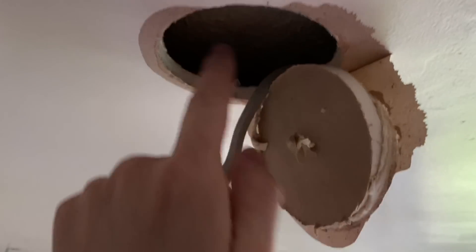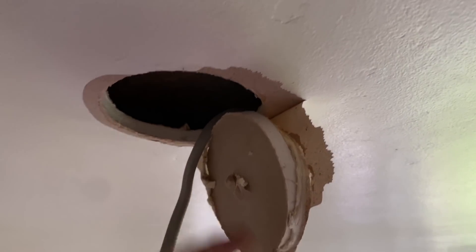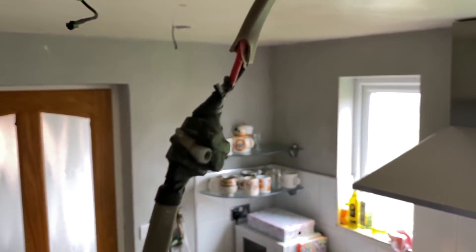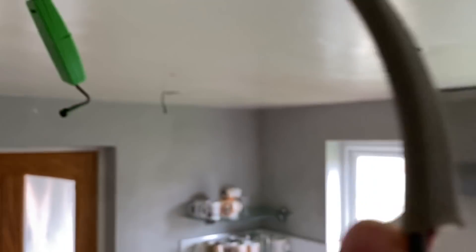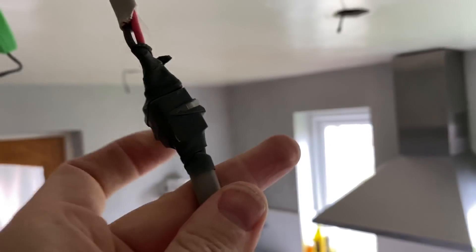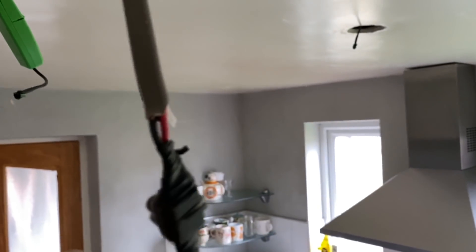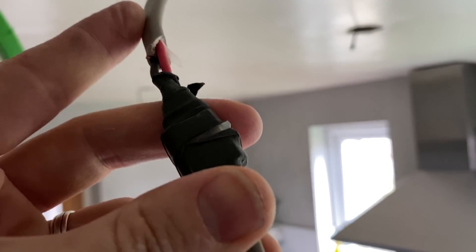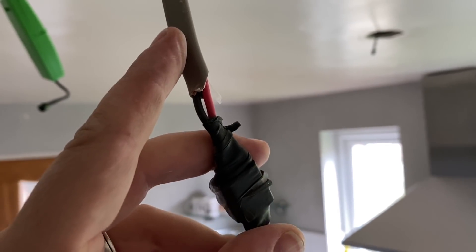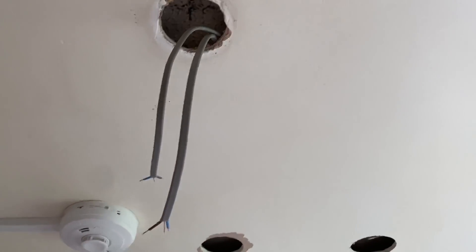I'm tracing these lights now and there was a hole that had been previously cut out in the ceiling. I had a look above it and found that's why we've got no earth to the lights — they've literally joined it in a connector block and just cut the earths off. I'm going to do a test now on the earth in this wire and hopefully we've got ourselves an earth so I can put a proper junction box on it.